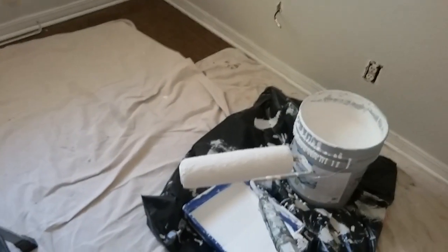We've got our flat white paint, and when my helper gets back she'll be able to film. Typically this room is about 10 by 12, so I like to start in the middle with my extension pole. I like to start in the middle where I can go all the way over and then come back and get more paint. This is popcorn ceiling - if you laid it out flat it would probably be like two rooms' worth of paint. I'm using a three-quarter inch nap roller today - you need a heavy roller to lay paint down on popcorn.